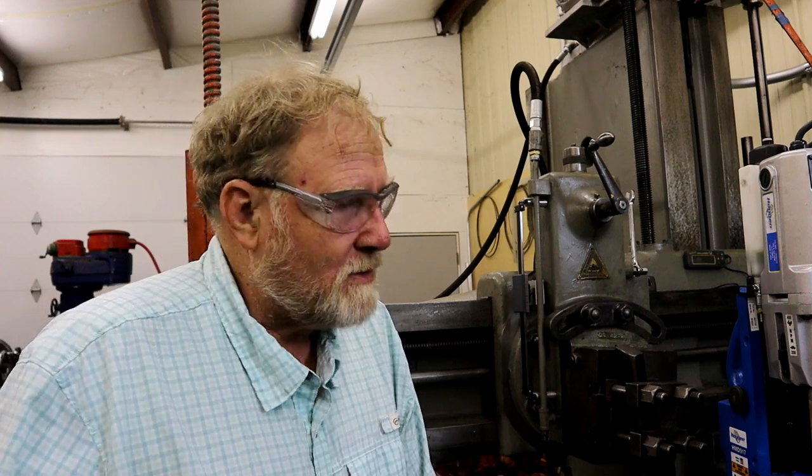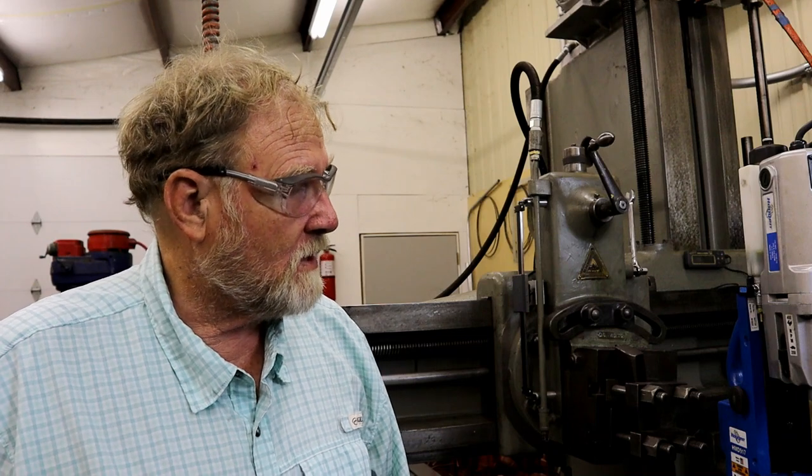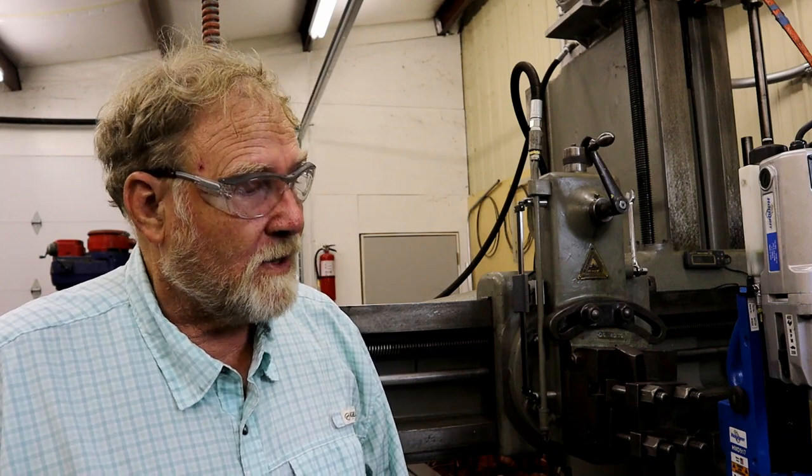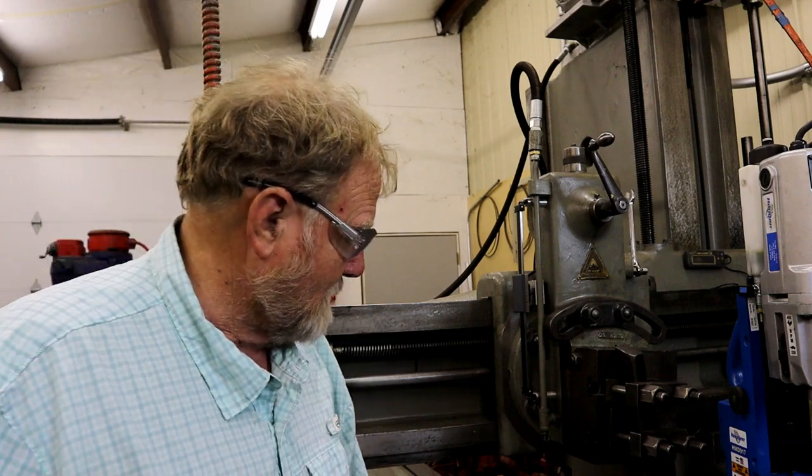People, if you're going to cast straight edges, don't put sheetrock screws in your mix. This is the third or fourth one I've found like this. They don't melt and become part of the mix. They sit in there floating around causing cavities and who knows what else. You know, this edge is probably going to be worth $1,000 when we're through. So don't put sheetrock screws in them, guys. Man.